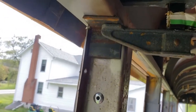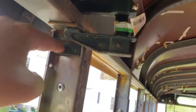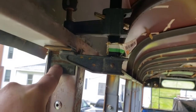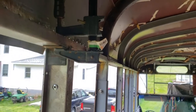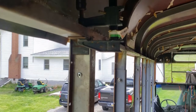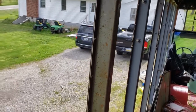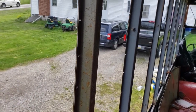I've cut some pieces of angle and got it clamped in place. I'm going to drill a hole this way and a hole up this way. After I rivet I'll drill the other hole so they line up. I'm going to put a rivet here and rivet up there and do the same thing on the other side, then I'll weld those in place so that the hat channel is good and strong in all directions. Then I'll weld on the inside here to join the various sections of hat channel and hat channel cap.